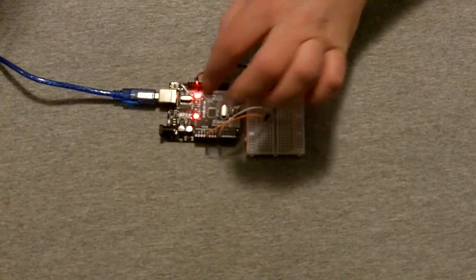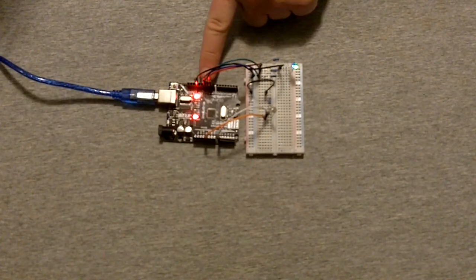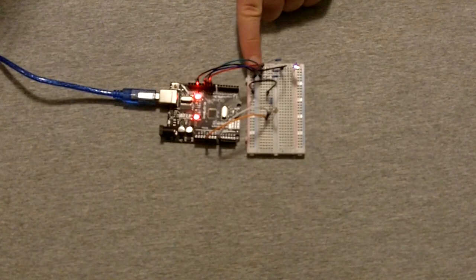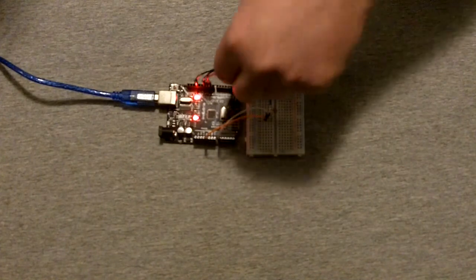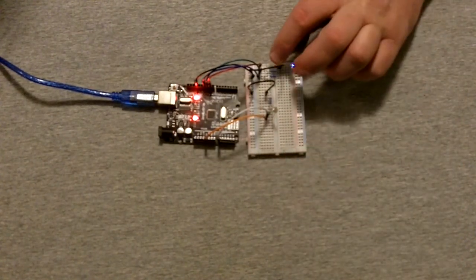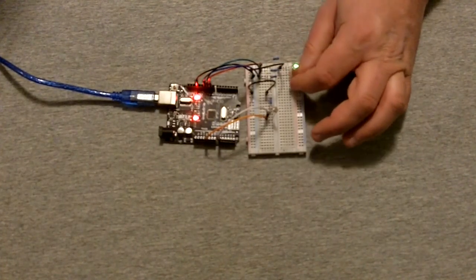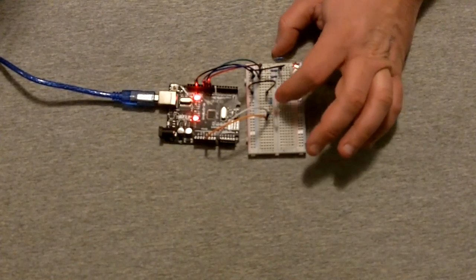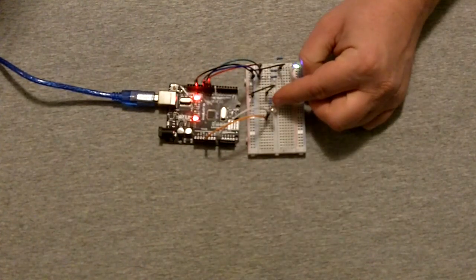I've got red, green, and blue on pins 9, 10, and 11, which are noted as being PWM pins. I've got my ground going to the second pin on the LED. It's kind of tough to see because they're bunched together, but if you look at the diagram, I just matched what was on there. And I've got my 3 resistors that tie together for the red, the green, and the blue. So 1, 2, 3. And then as far as the photosensor, we still have the resistor going across and then putting the signal to ground.